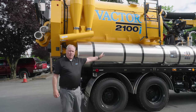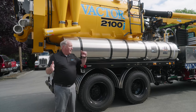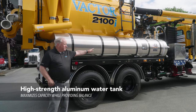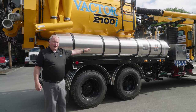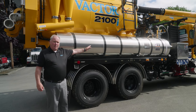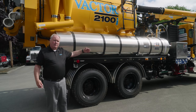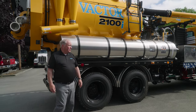The water systems on our tanks and our trucks — we want to make sure these trucks are balanced with all this weight and we use these aluminum tanks. The aluminum tanks are designed for 1,300 gallons of water. This truck happens to have 1,000 gallons of water on it. They're made at VACTOR and they're designed with a baffle everywhere there's a weld so it doesn't slosh around, keeping the truck more stable as you're moving around to your job sites.